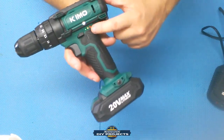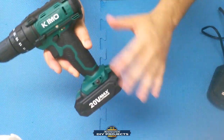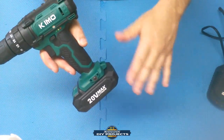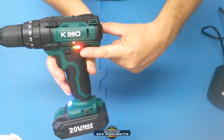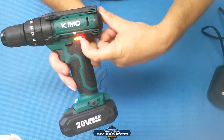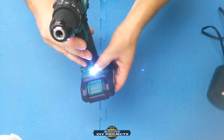There's no indicator on the battery itself — similar to Hart batteries on the 2.0 amp-hour size. However, unlike Hart which has no indicator on the tool either, this tool has a battery indicator right on the drill. Simply pull the trigger and it shows three lights — green, yellow, and red — telling you exactly how charged your battery is. As the battery drains, the green goes away, then the yellow, leaving you with red.